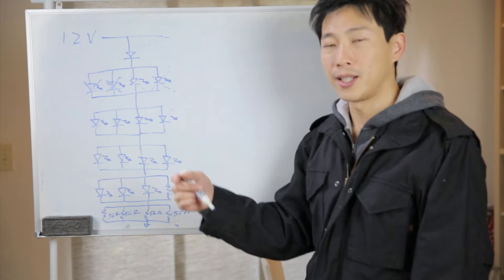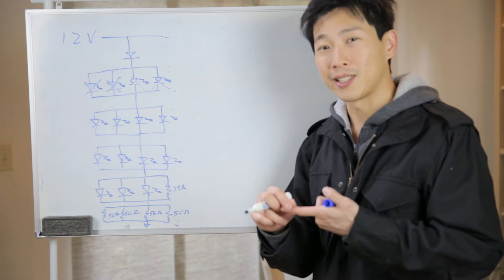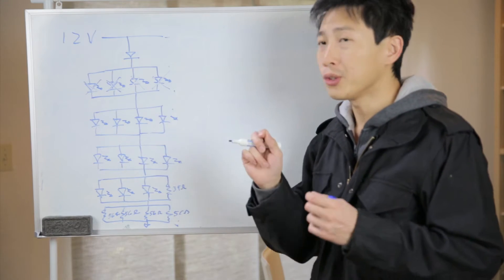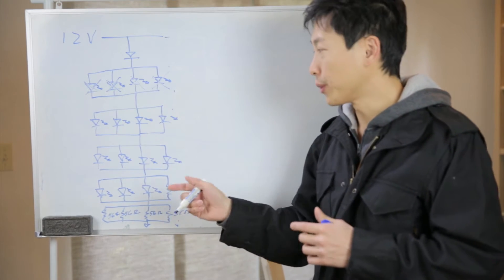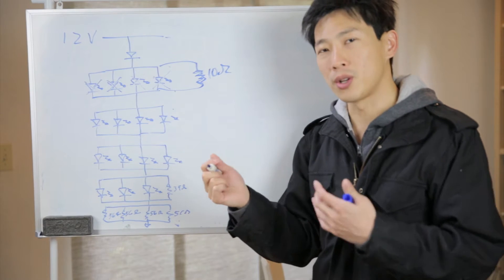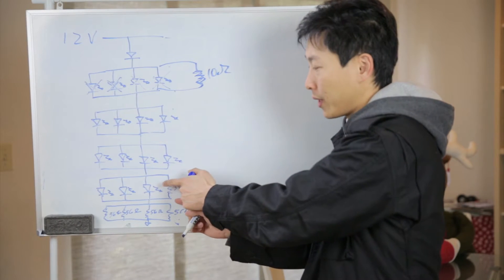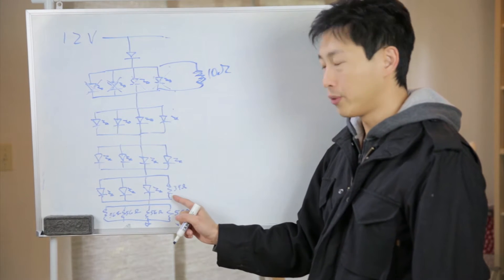If you have a bunch of LEDs that are broken and want to source parts, that might be difficult because you need to find the exact part. What you can do is just short across them, but don't use just a piece of wire because that's going to cause the rest to be overdriven too hard. Instead, replace those LEDs with a resistor so you can jump across them but still supply the same amount of current — similar to how this module uses a resistor alongside only 3 LEDs instead of 4, so it doesn't overdrive them.